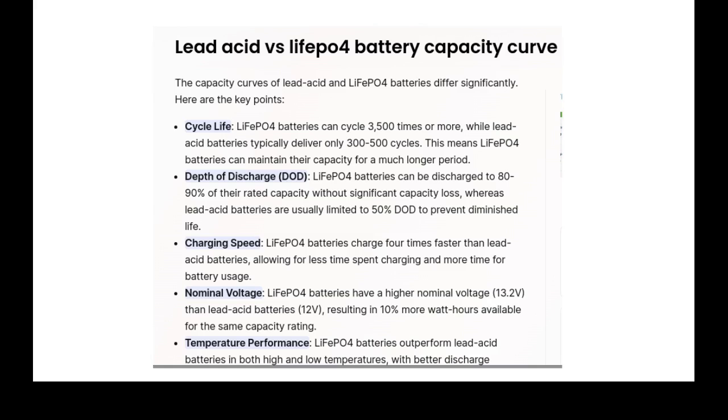This is the maximum fully charged voltage on the battery if you don't have anything connected to it. On lithium it's high — it plateaus and then falls. It's high for 90% of the duty cycle, and then it drops. Once you've used 60% of a lead acid battery, you're already below the rated voltage — below 12 volts. That's correct. If you take lithium very close to zero, you can never recharge it again. That's why you have a computer inside the lithium battery — it shuts itself off and protects it.